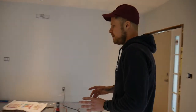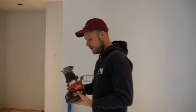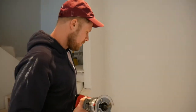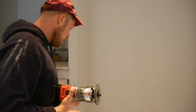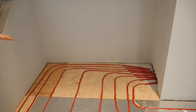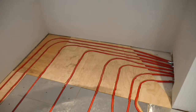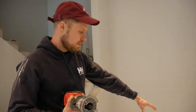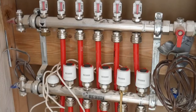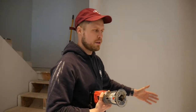The next thing I want to talk to you about is where your router comes in. I used this little Milwaukee router — I might actually suggest something a little heavier duty, this was quite the workout for this little guy. You're going to want to take these pieces of plywood and, before you screw them down, actually work to loose-fit them in here. I drew some lines on here of how I wanted the tubes to go, and then you can see as we've done the tubing install here, we just cut the piece off and fill it with a little bit of self-leveler to get it into the manifold the way that you want it.